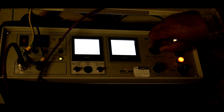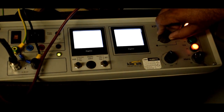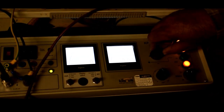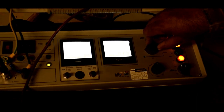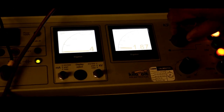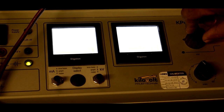At the other cable end, slowly rotate the voltage selector — preferably at one kV per second in intervals — until the 10 kV test voltage is reached. The voltage is to be maintained for one minute and the leakage current after this time is to be recorded.